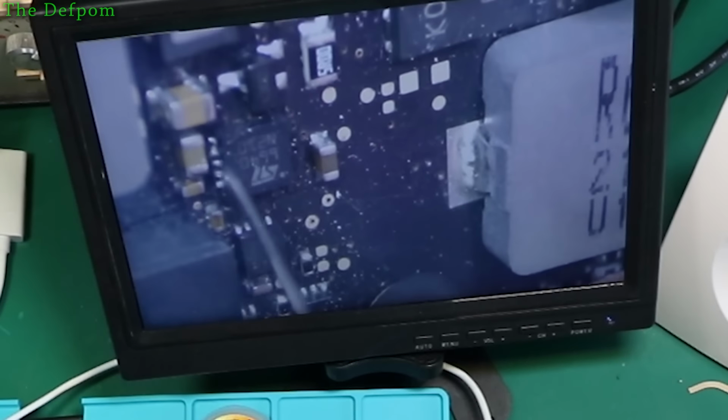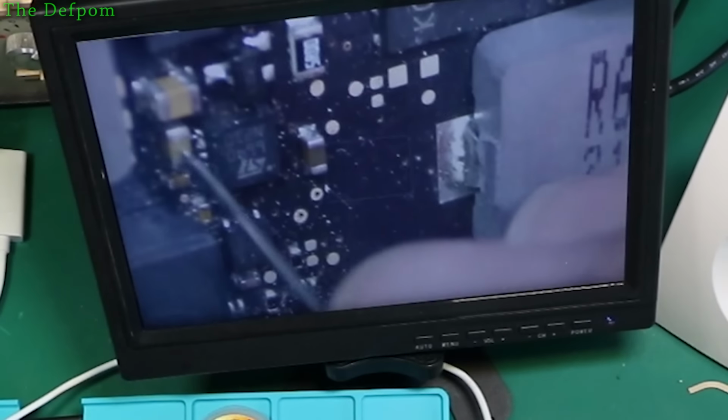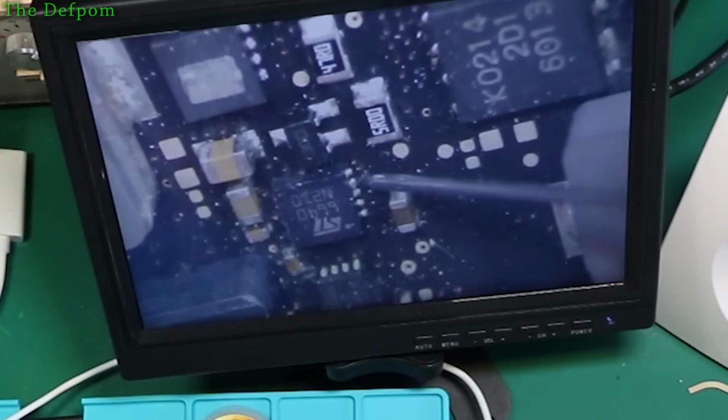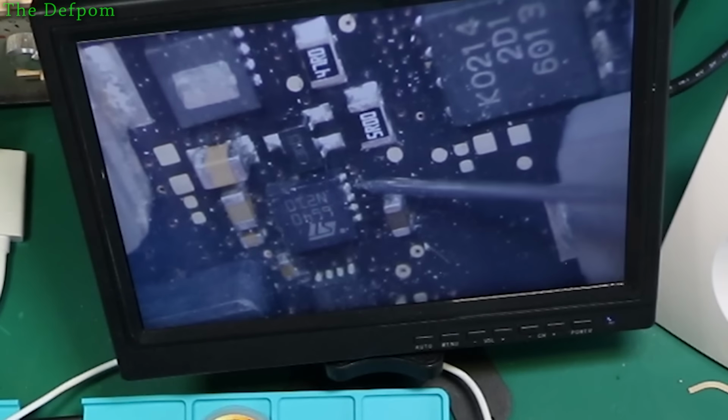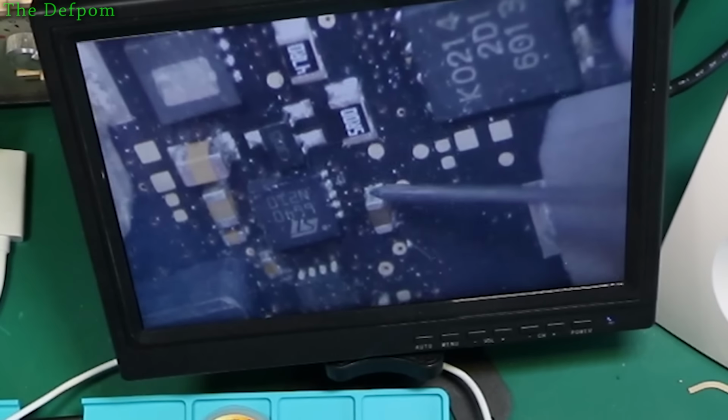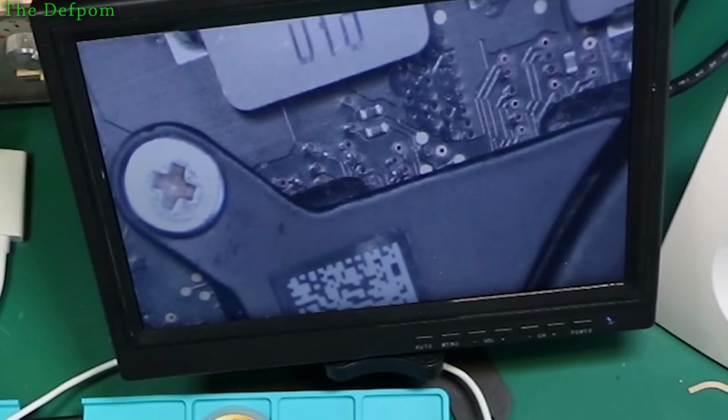There's nothing there. So we soldered them all there. So there's the via. There's the pin. So I'm not quite sure why those two pins aren't going together. Maybe the via is underneath that chip. Let's take the chip off. I don't really want to, but I think I'm going to have to.